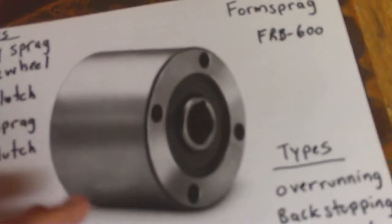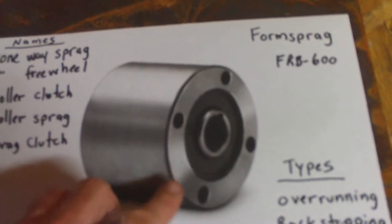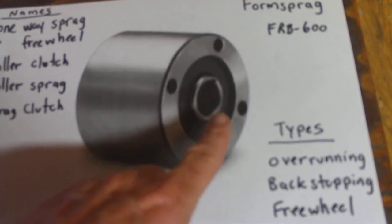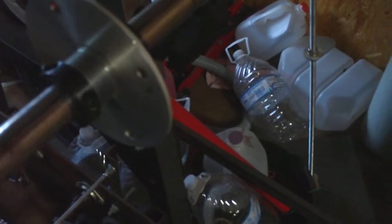When the weight is falling — about three or four hundred pounds — it turns the chain attached to the big colliery wheel up top, which drives a sprocket on the shaft. That turns the outer race, which locks internally to the inner race, so the shaft turns too. That shaft has a sprocket with a chain going down to the gearbox, driving the system through the different axles all the way to the permanent magnet alternator, the PMA.